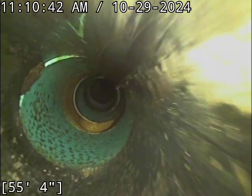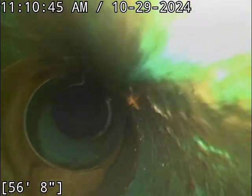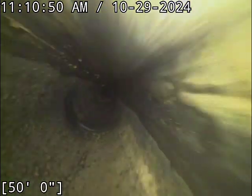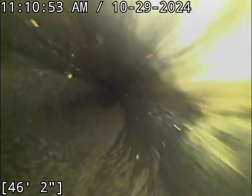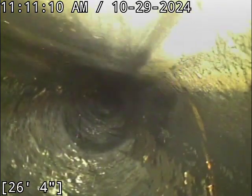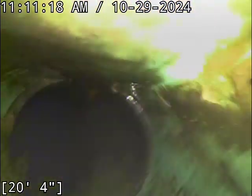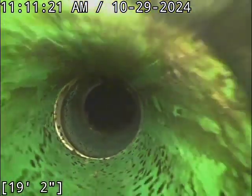And those are side tie-ins there. My camera right now is kind of upside down. Those tie-ins are actually coming in at the side. So it does appear you've got a shared line with at least this side of the building rows. And the way these are working here, you've got a line for every 2 units. I believe I've seen that many tie-ins beyond the stuff here. As for the other building row on the opposite side of where this one sits, that may very well have its own dedicated system. Without getting a camera into all the lines to see where everything intersects, it's hard to say. But from what I can see here, it looks like at least this building row on this side is tied together.